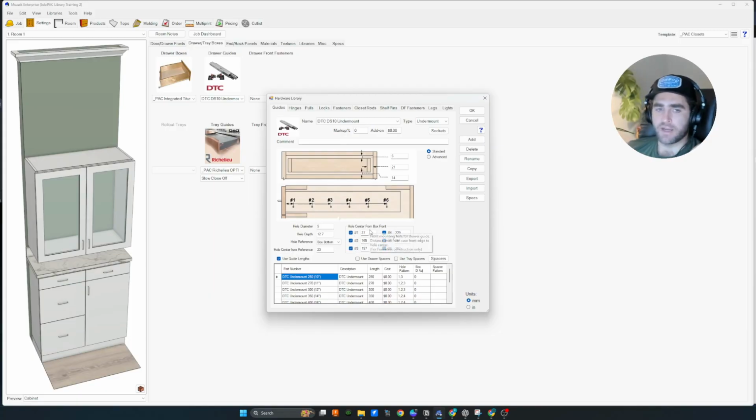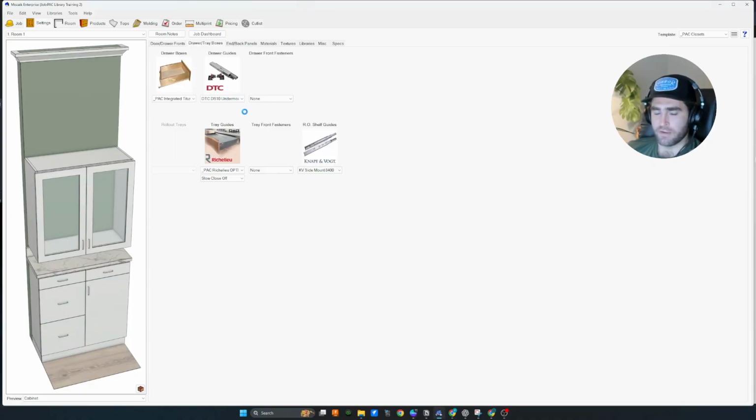And normally for the line bore, we would just turn all these holes off. But we're going to let it drill its own holes inside of the section. It's not going to line up with the line bore, but that's fine. All your drawers will come out right, and it's not the end of the world. The only downside is that now that panel is not reversible. It is the only panel that will work for that spot, which is not really a big deal.